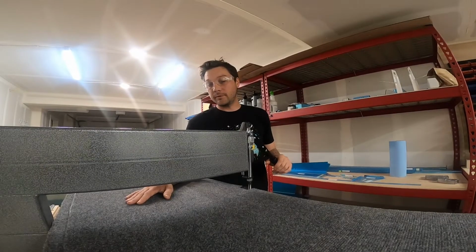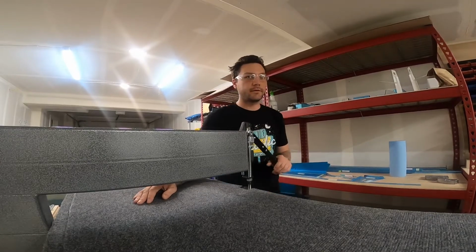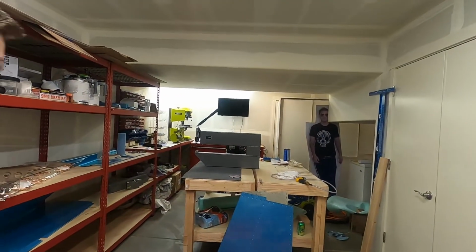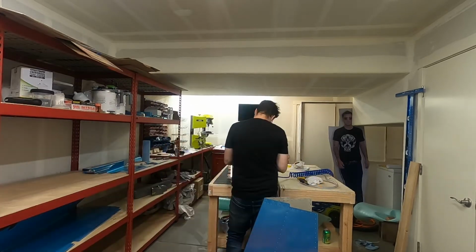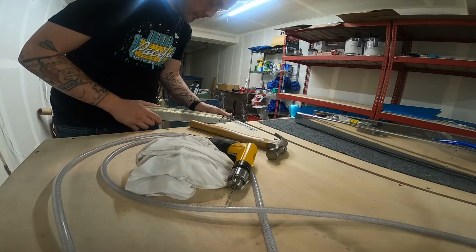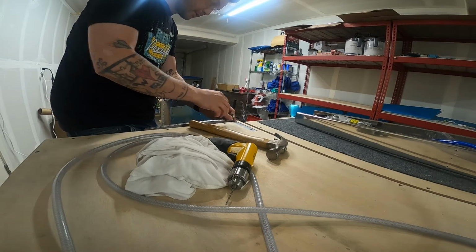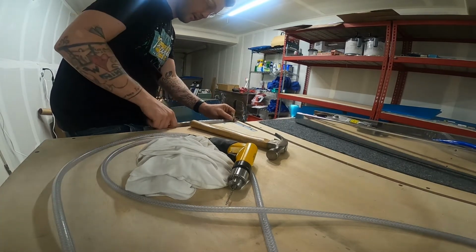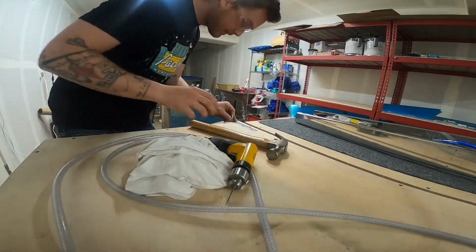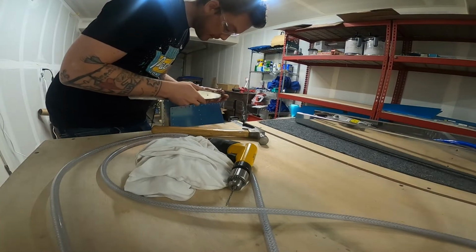Skin is dimpled, so I'll put away the Dimple Master 5000 and get out the squeezer and start dimpling the structure. Being careful not to dimple anything that should be countersunk or vice versa. This contraption at the end of my table, but some spots are too small for the squeezer to get into, so you gotta do these hammered dimples. They're like my least favorite. The Dimplomatic's pretty easy. The squeezer's pretty great. This is sort of a joke. But it works. Kinda.